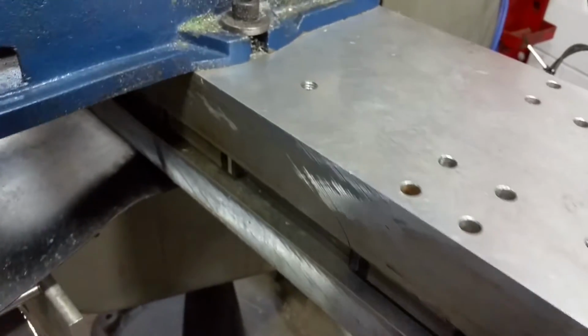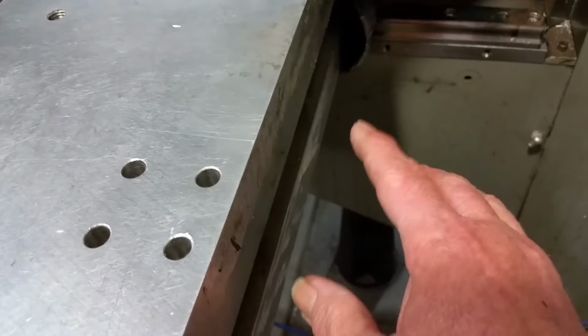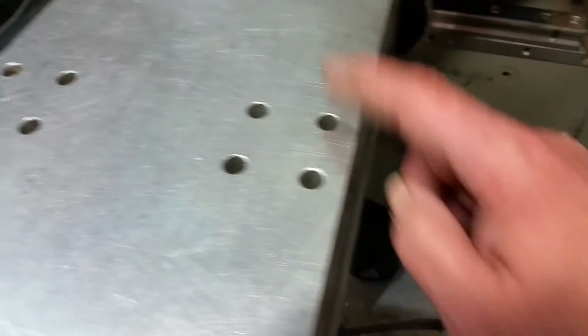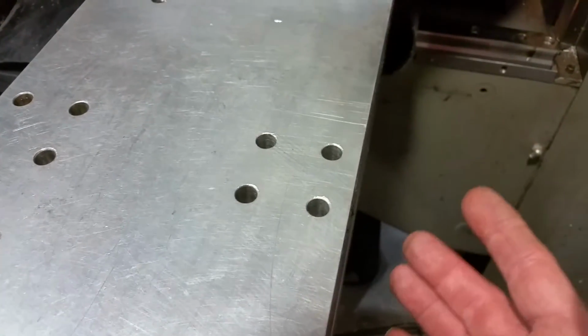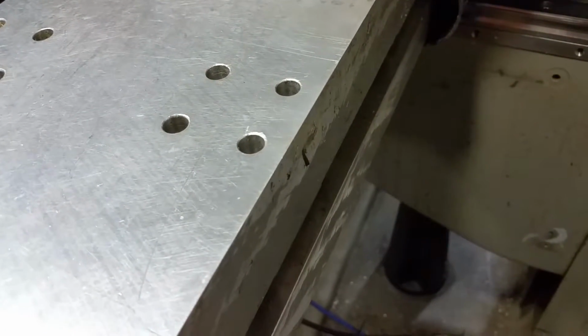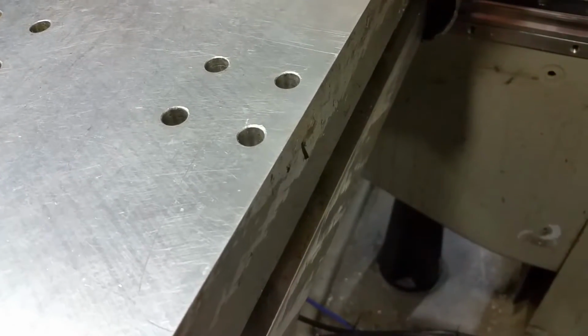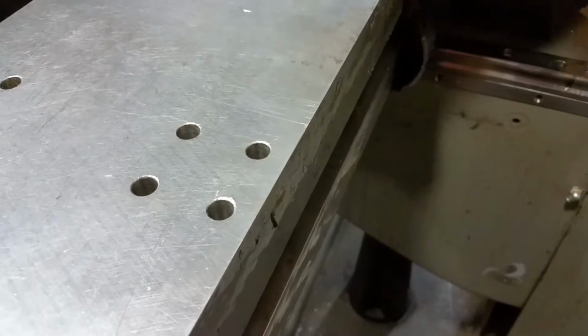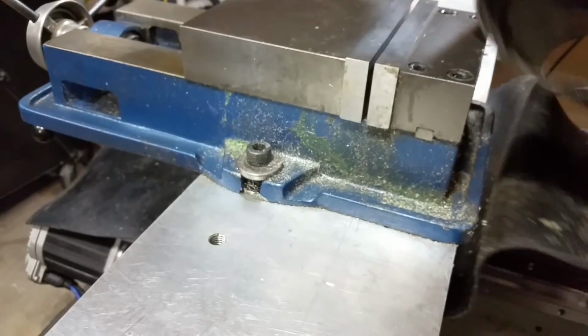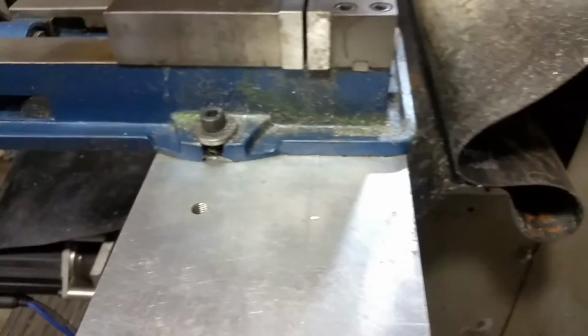So, and then mounting the table onto those rails. All right, here's 4 holes. All right, for this bearing block, the screw goes through. Again, I was lining it up, keeping it parallel with this back edge, okay. And it was so long ago. I want to say I ran an indicator across the back when I was finished, and I must have been happy with it, because I really don't think I would have let that slip by. But that's really all I did.